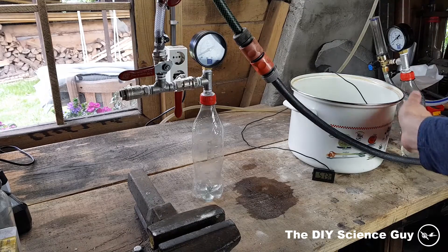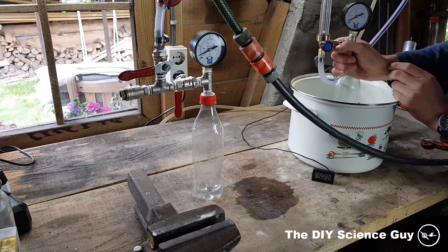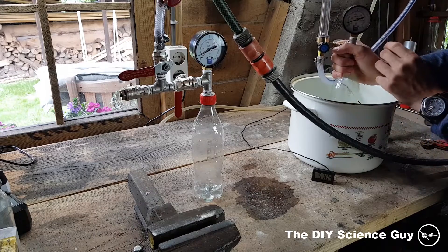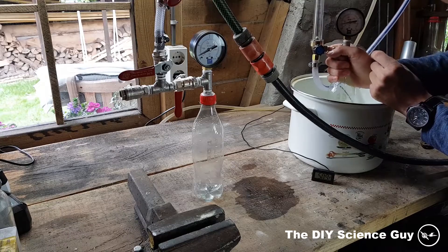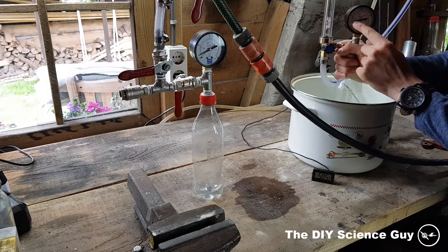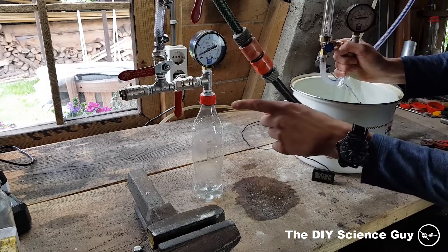My pot of hot water is about 51.3 degrees Celsius. I place the boiler-side bottle in here and shake it a bit, because the soda bottle is a poor conductor — rotating it exposes more of the butane to the bottle sides and stirs water around it. You can see the pressure rising, and it's higher than the other side because the valves are closed. I open the water valve for a steady flow, then open the main valve and you can see butane flowing out. The pressure here is still high, the pressure there is still low — so there's a pressure difference.